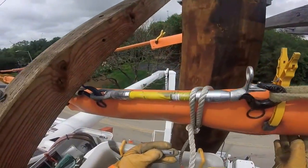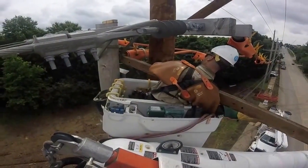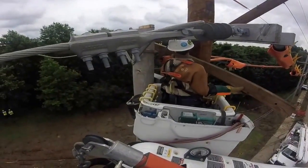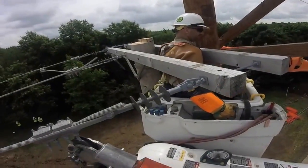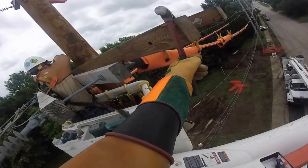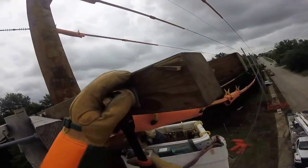So now they can have a little more room to put in the second part of the new cross arm, which is what the lineman is doing here. You can see how tricky it can be sometimes to maneuver and fit things in. In this case, for instance, you see the lineman actually having to come up between the arms of the old cross arm and maneuver through that and around that — a real contortionist job up there — as he's securing the bracket and the second arm of the cross arm. Now they're going to tighten the two cross arms together.